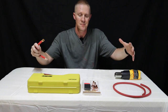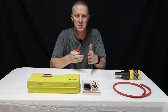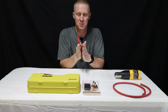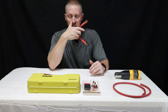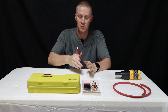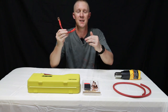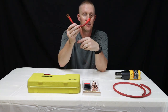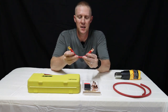If you're setting up a battery bank, the batteries should all be basically in a grid — equal distance apart. They shouldn't be butted up to one another unless they're lithium. Lead acid, you want to leave some space between them so they can breathe. You might have a battery somewhere over in right field; you're gonna want to make sure all your cables are the same length. If one of your batteries is just a little bit further away and you have to make that cable longer, make them all that size, just so they have the same resistance.